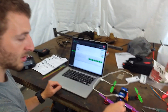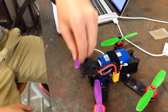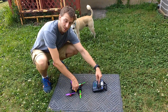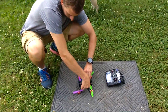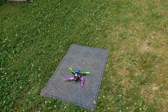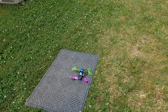I'm going to take these up so you don't get them in the way of the propellers. I might just hot glue the antenna right through this hole and leave it like that. First flight - make sure your arm switches are set: you can't even turn it on with any switches down or throttle up - it'll say 'place all switches in their up position and lower the throttle.' I'll lower the throttle, turn it on, plug it in - it beeped. I arm it and give it some gas. Watch out Rufus, get away - you could get your nose chopped off.